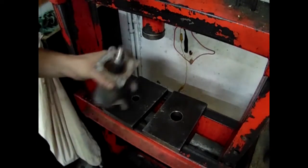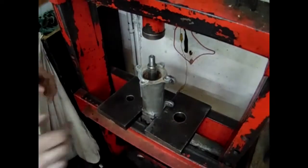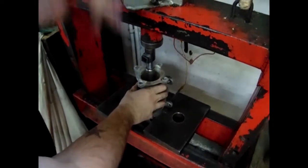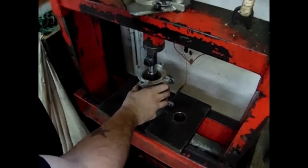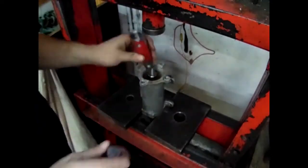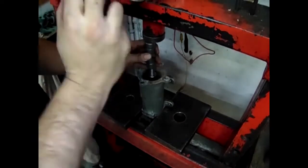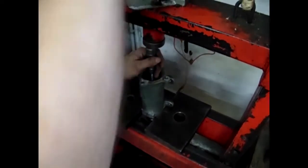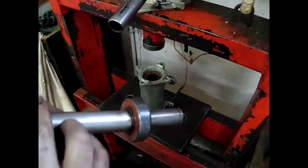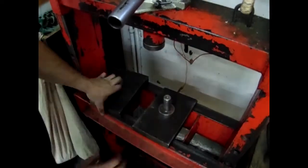With the large snap ring removed, press the shaft out of the body from back to front. If it feels like it's locking up on the press, if you're using a press, stop what you are doing and investigate. Some pump assemblies are built with the shaft being pressed from front to back. If you are unsure which way to press, the schematic should be available on the manufacturer's website. The Root Supreme long shafts and Transland long shaft pumps are pressed differently, in the different direction. Again, we are overhauling an Agronautics 65200 series pump in this video.